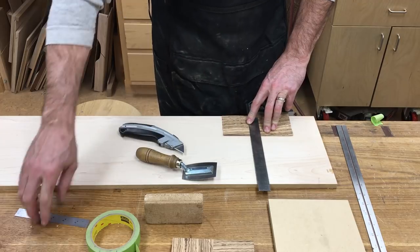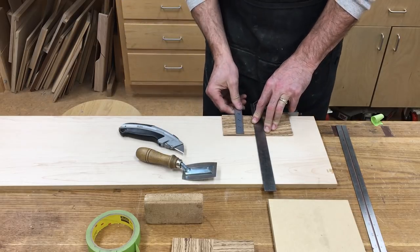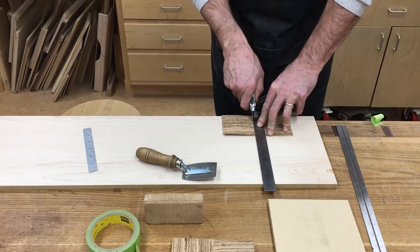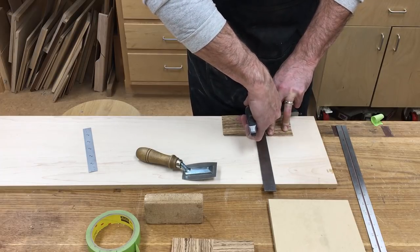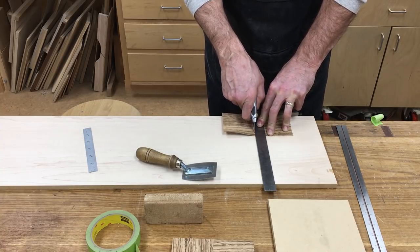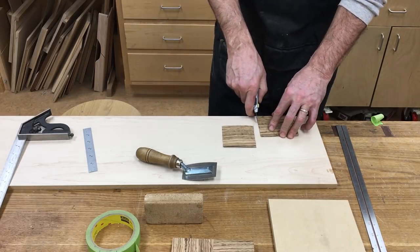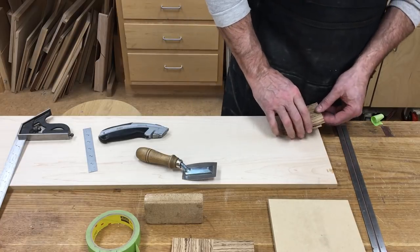I've checked that my end is square, then I measure over the width of the veneer — since I want these pieces perfectly square — and cut to length using my utility knife. I cut from one side to the other, then start on the other side and cut toward the middle, taking light passes without pressing hard until the veneer breaks free. Cutting from both edges prevents the knife from catching and breaking out the far edge, giving a much cleaner cut.